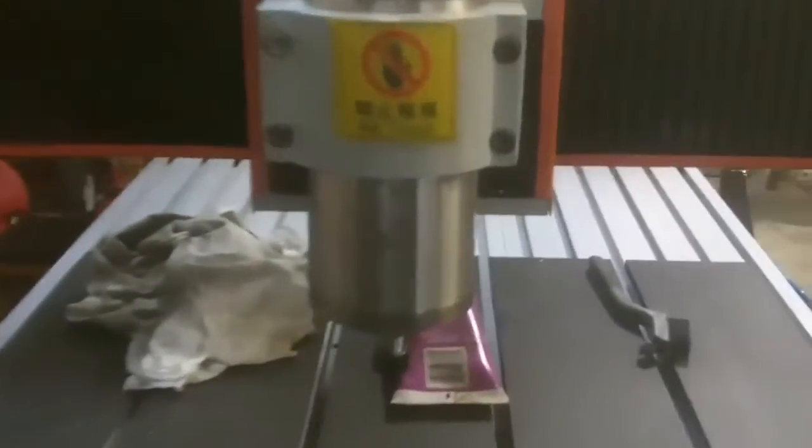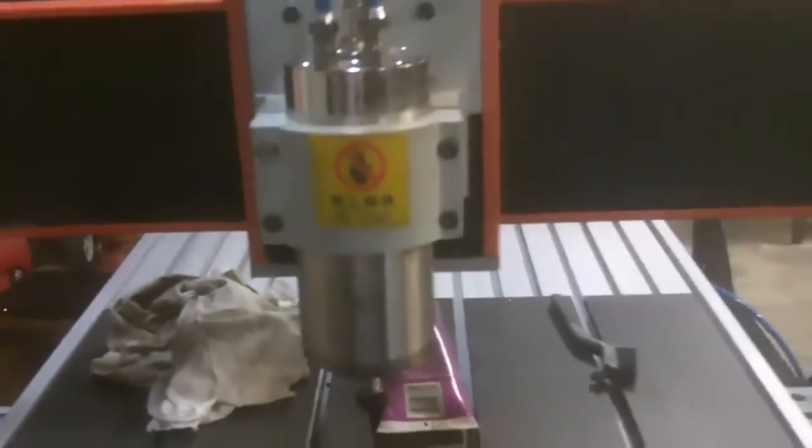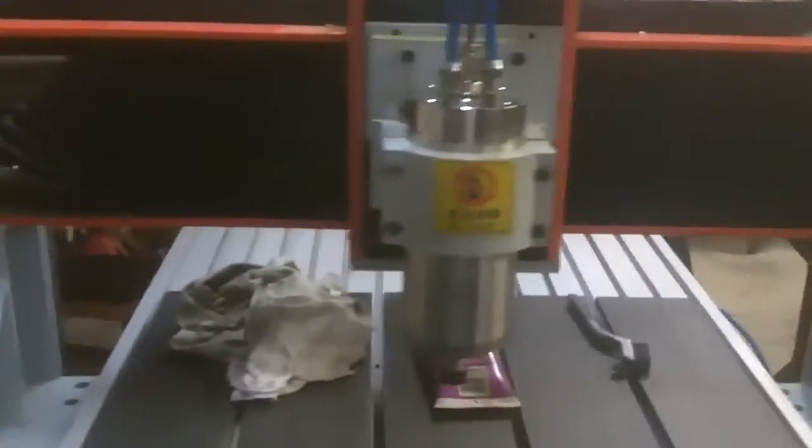So it's a J-Cut 6090A, as it says there. It's got a 1.5 kilowatt spindle. It's made mostly of cast aluminum and cast iron with a welded steel base. It's got profile rails and round supported linear rods, which isn't bad for my first CNC machine — and I don't see how it would be all that difficult to replace. Look how it mounts — nothing too complicated.